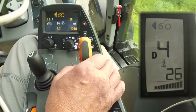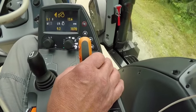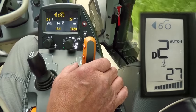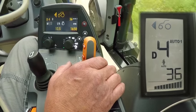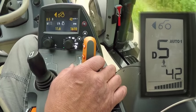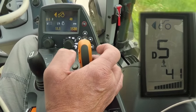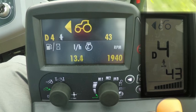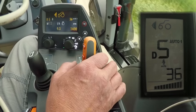We can change the gear lever back into manual mode to prevent an unnecessary change back to C range. From the armrest display we can follow the engine revs changing. When we go to the main road and start accelerating, we can move the gear into auto 1 again and the automatics take care of changing the gears. Engine revs stay low at around 1500 rpm. Versu is travelling at 53 km/h using 1900 rpm — it's quiet and it's economical. If driving in hilly conditions, our speed at the moment is around 43 km/h in D5. This speed can also be reached in D4. In manual mode we can gear down to D4 — the speed stays the same but we get more engine revs and more power to pull uphill if needed. Now we have 1900 rpm with D4 and the speed is still 43 km/h. We can activate auto 1 again and the tractor changes automatically back up to D5, saving fuel.